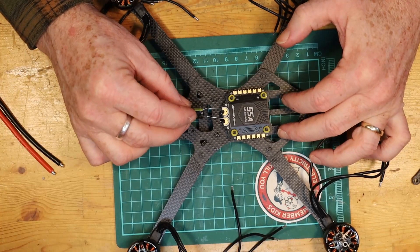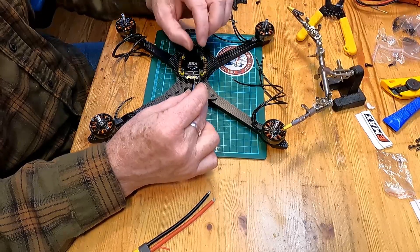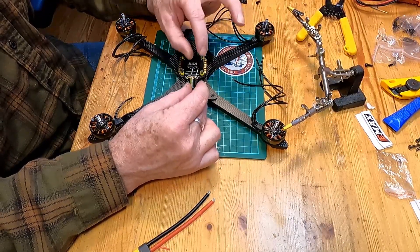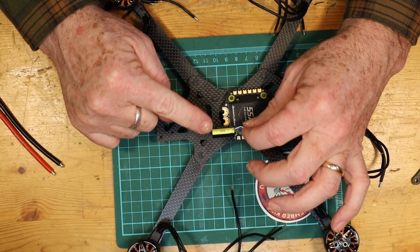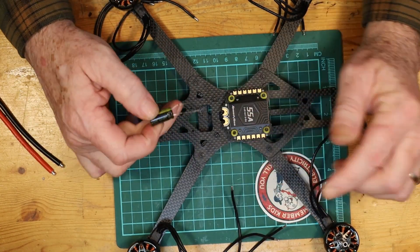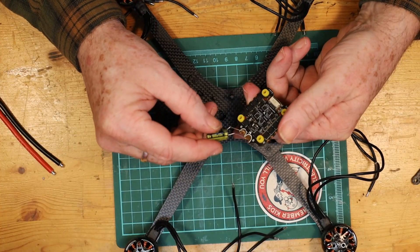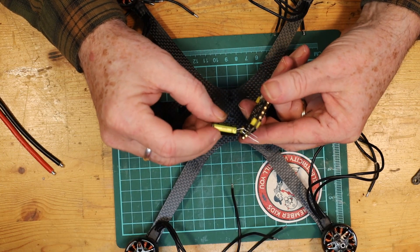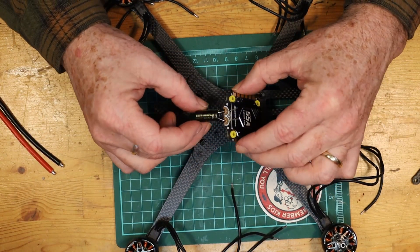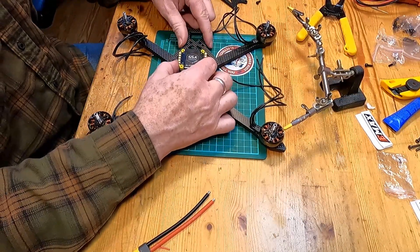You can see that this ESC has holes in it — those holes are meant for the legs of the capacitor. Before you put anything in, make sure you see the side marked negative on the capacitor, which typically has a bar on it marked negative, and make sure you're going to attach it to the negative terminal on the ESC as well. The way I like to do it is take the ESC off, find the two holes from the bottom, put the legs of the capacitor through, and with everything still straight, put the ESC back onto the stack screws where it's supposed to be.